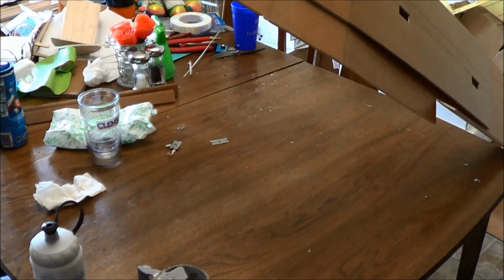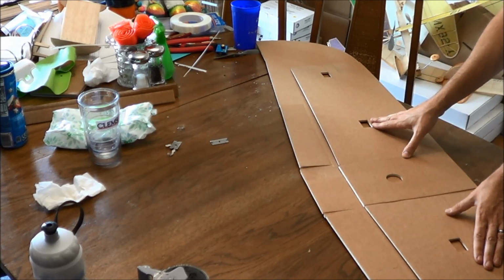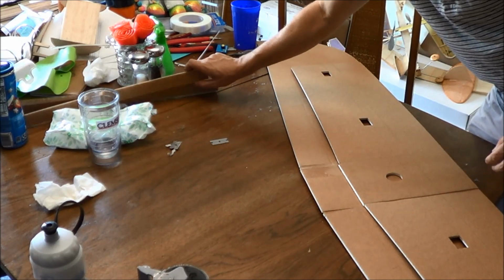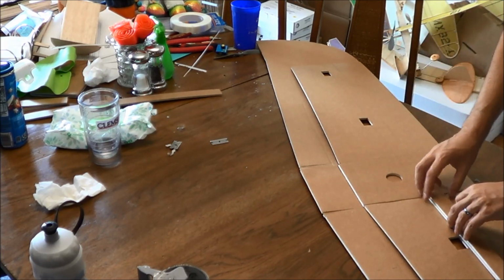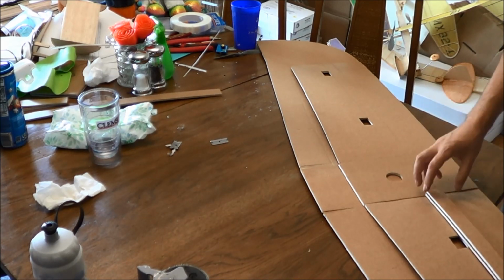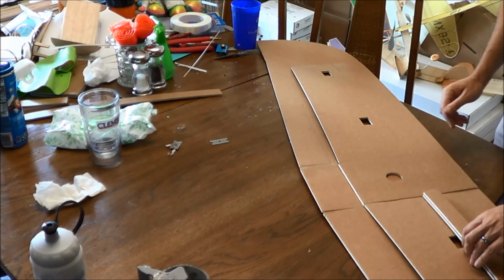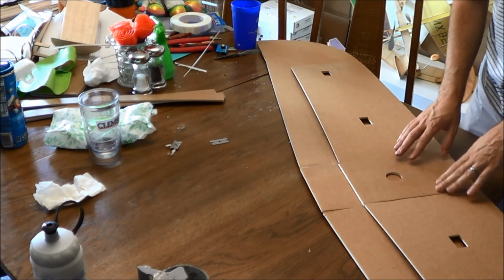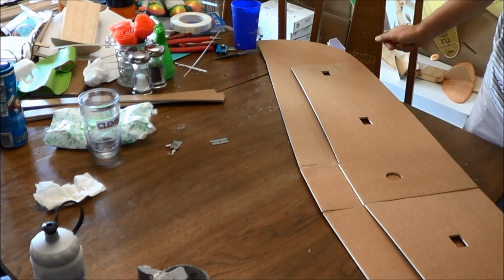After that, just to prepare you for where we're headed next, we'll build up our wing spars on here, carbon and foam composite sort of, we're going to build up the foam spars. We'll throw a couple of them on here, like so. This intersection and so on, and then we're going to lay some serious carbon spars across the front of that. That's going to be your actual wing spar, and it's not going to be interrupted across here, so it'll come out like so. And that's going to provide you with the structural rigidity that you really need on this airplane. Because this foam, even if it was continuous across the center section, is not going to support this airplane. So we'll get this leading edge beveled and then we'll come back.